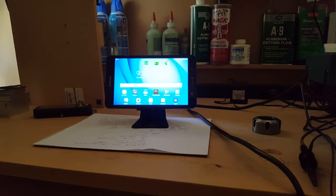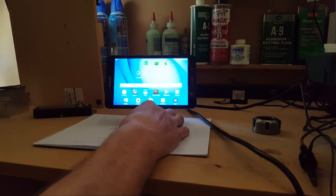The first thing you need to run the Blue DRO is an application called Touch DRO — one word, no spaces. Touch DRO requires an Android operating system of at least 4.0. You need a device that has Bluetooth capability, and it's recommended to have a 7-inch screen with 800 by 480 or better resolution for the screen to properly lay out. If you have an iPhone, you're out of luck because it needs the Android system.